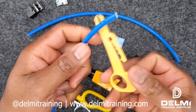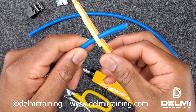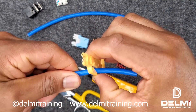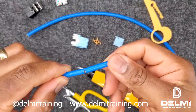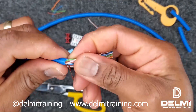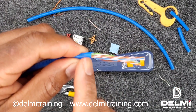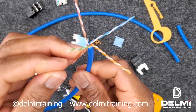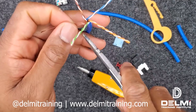I'm going to strip a piece of the cable and prep it and make it ready. With my cable strippers I feed my cable through it, squeeze it down a little bit and spin it around the cable. What this ends up doing is it causes a nice clean cut on the jacket of the cable. I'm going to take that off. Always make sure you inspect — give it a second look to make sure that you did not cut into the cable itself. Also included in my cable is a cable divider, so I'm going to cut that out.